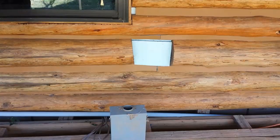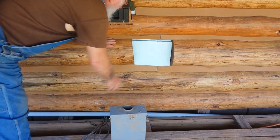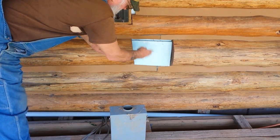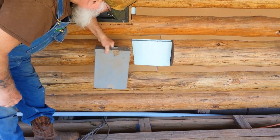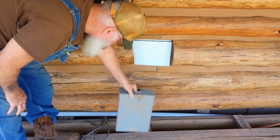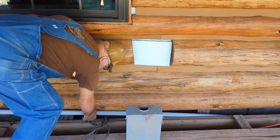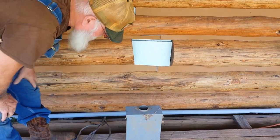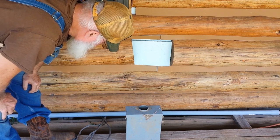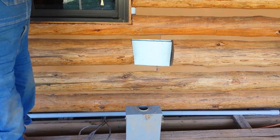I'll show you where my box is going to be. This is my wood box and it's going to go this way — I'm going to make it bigger. My box is going to mount somewhere right in here, on this side below my window. I got this conduit I'm going to run underneath the house, run my wire through it and come in through the bottom. I have my dining room light right here, and then I got my outside light to the back porch right here, so there will be two switches here by the back door.